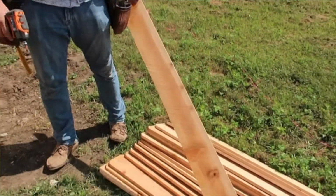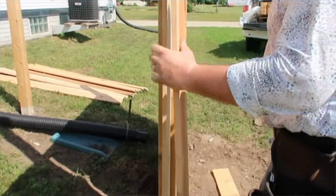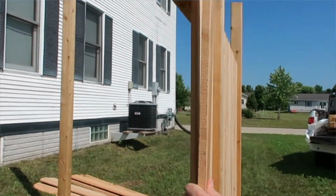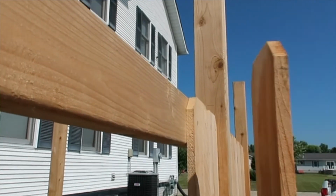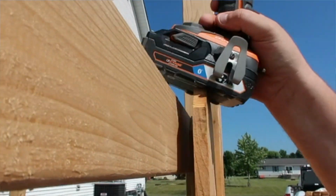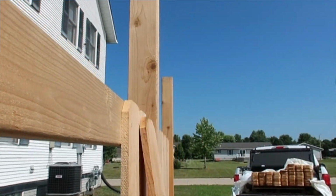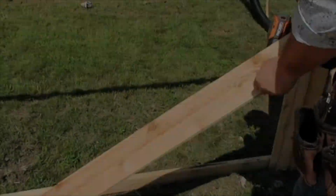And it's all cedar, and it smells amazing. You don't have to protect cedar. It doesn't rot like a lot of other woods. And even pressure treat will go gray after a year and a half. You have to stain it or protect it. With cedar, it's all natural. It's meant to be outdoors. You can still seal cedar, but you really don't need to.